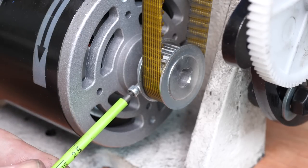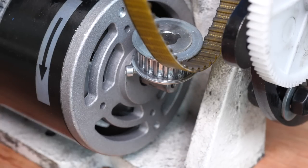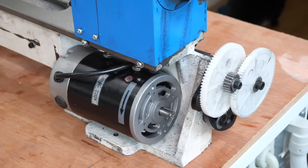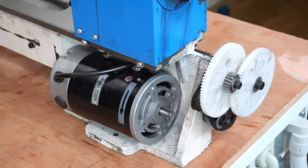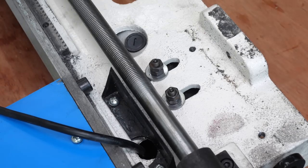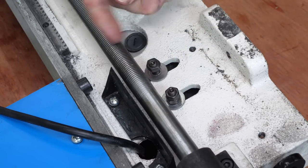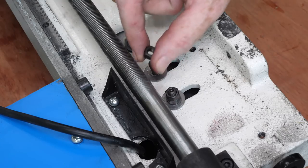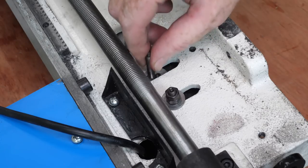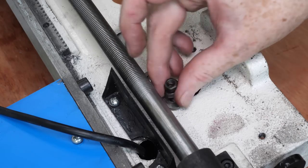The belt pulley is held in place by a single screw, but once the screw is removed it's firmly enough in place to need to be prised off. Now everything is out of the way, we can see that the motor mounting studs are loose and look bent. The reason this has happened is they're much too small for the mounting holes in the bed casting, and only the very edges of the washers are in contact with the face, making it very easy for them to bend. Washers should be clamped between parts, not stretched across a gap like this.